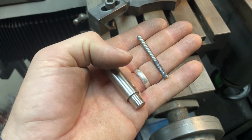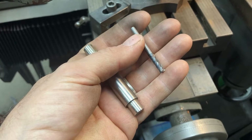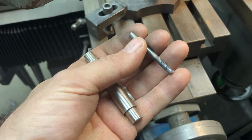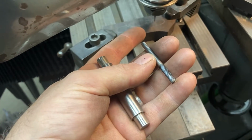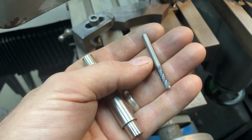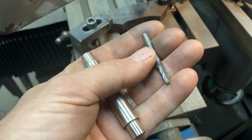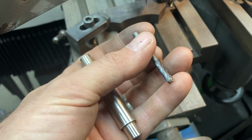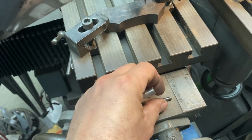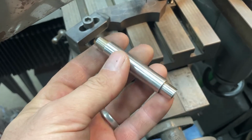A quick note on cutter and stylus choice. So with a 16th inch end mill to do the negatives, it takes forever of mowing the lawn inside those inlay pockets to do all the passes necessary to remove the material with that tiny cutter. So we're going to remove most of the material with a 3/16 4-flute carbide end mill, and because of that we're going to use a 3/8, double the size stylus.